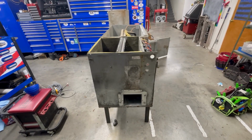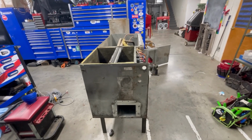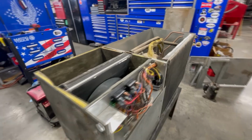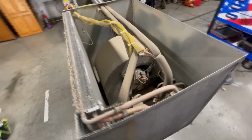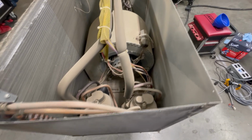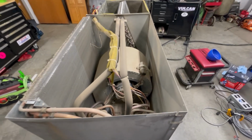Okay, so the next one is a 6538-871 out of a big Winnebago Ellipse. And you can see this is the high efficiency. Now, we do have a replacement for this one in stock. Lewis did the test on it just a few minutes ago and did determine that the compressor 2 is locked up on it. So we're gonna get in here and see what's going on and check all the tubing, see if we can figure out why it's locked up, if it's just a compressor, if it leaked.